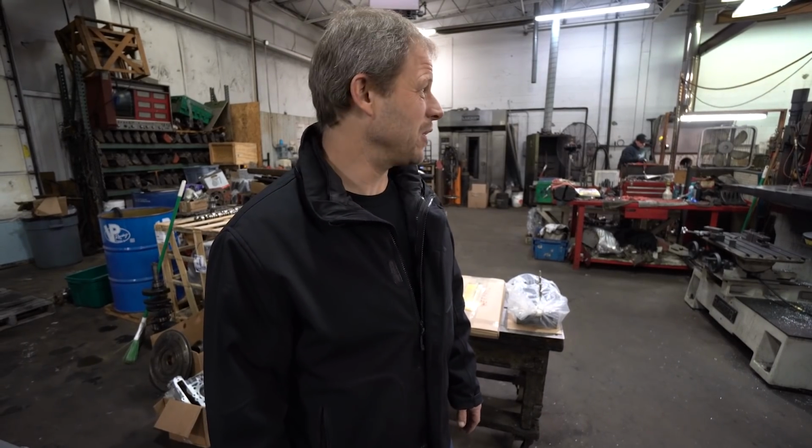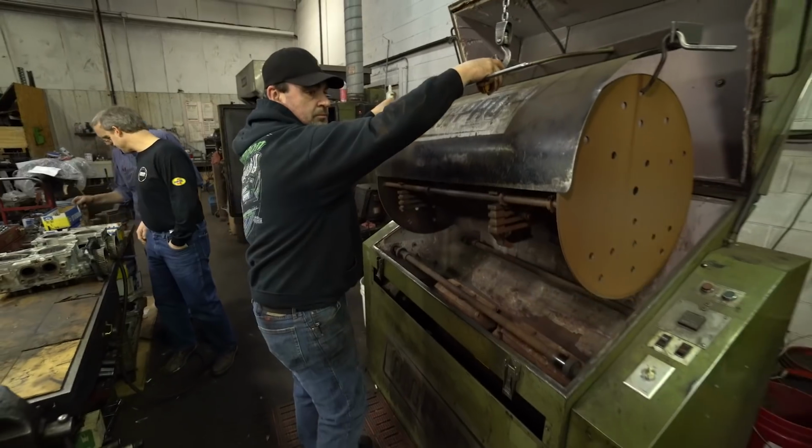We know it's been sitting a long time, and since we had to bang every one of those pistons out and there was a big ridge on the top, I'm afraid it's not going to be able to just be bored, but we'll let these guys decide what it needs for sure, and we'll get to that discussion, but let's look at that block.